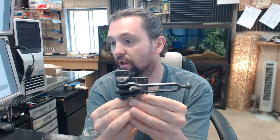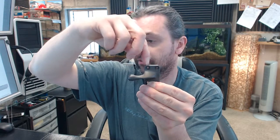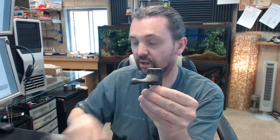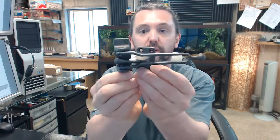You are going to install from the edge of the door to the center line of the holes nearest the edge of the door: 15/16ths of an inch. Then your installation from the edge of the frame to the center line of the first holes will be 3/8ths of an inch, as you can see from the drawing. Those dimensional relationships — the 1-1/8 inch, the 3/8ths, and the 15/16ths — will give you the proper installation so that it works correctly.